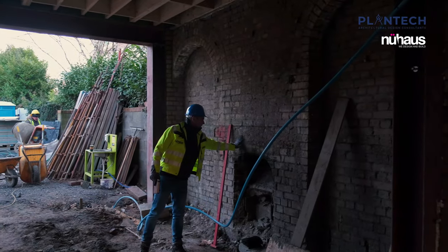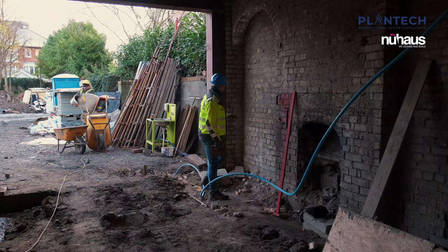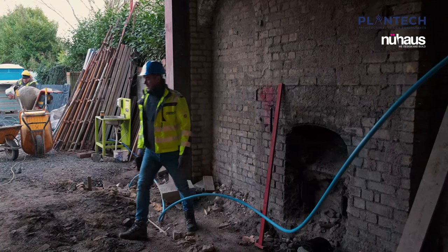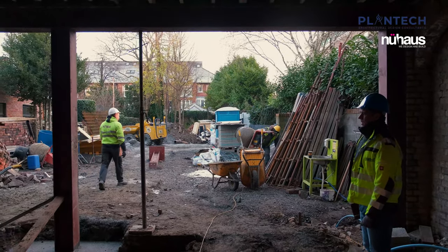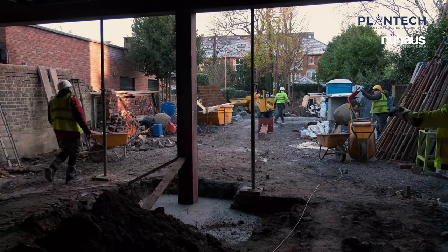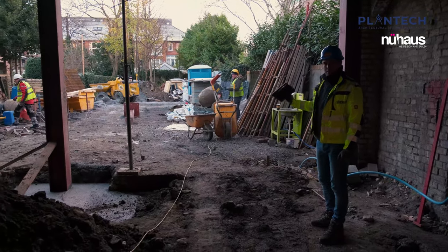It's all going to be repaired and made good. You can see the original brickwork — we're going to reclaim and repair as much as possible and leave that exposed with some shelving and decoration. Here at the back of the house you can see the huge goal post frame our engineers designed and the crew have fitted. We've also got a central column. All of these steel columns — three columns at the back — are going down to 1,200mm square RC pads, and that's supporting the whole back wall of the house.